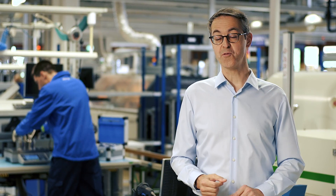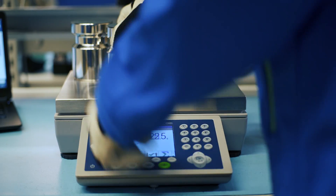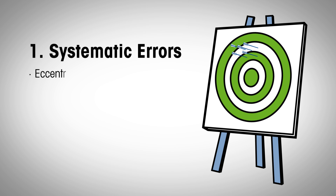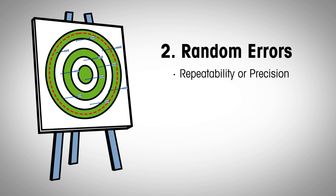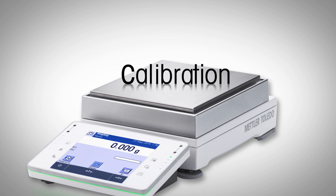Klaus mentioned the performance of weighing equipment — let's have a look at how it is assessed. The performance of your weighing equipment is influenced by two types of errors. First, systematic errors like eccentricity or corner load, and error of indication, which is also called non-linearity. A systematic error shows you how far from the true value your result is. The second type is random errors, which is assessed by testing repeatability to tell you how close together a series of measurements is. This is also called precision.